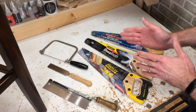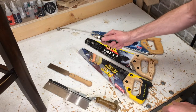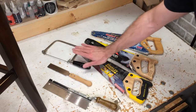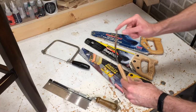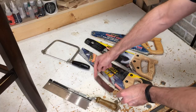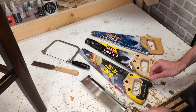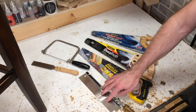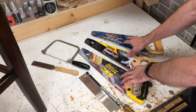What we're looking to do is accurately cut a straight line. A coping saw, which is typically used for curves, is not the right tool. Also a flush cut saw with a flexible blade is meant for cutting things flat — it's not the right tool for the job here. So we're down to what I've got here: a dovetail saw that I purchased at a big box store and some 15-inch saws.